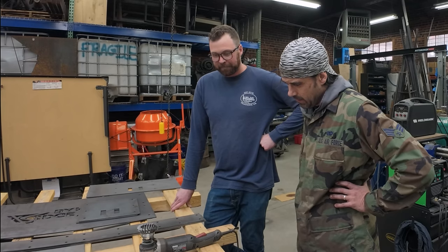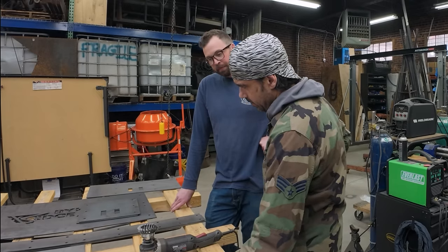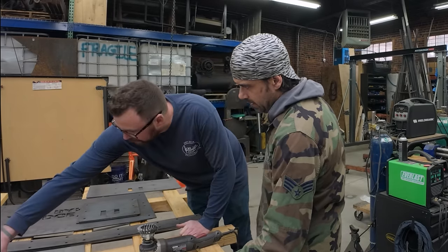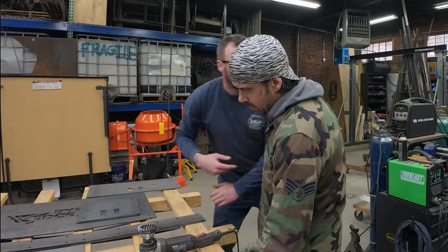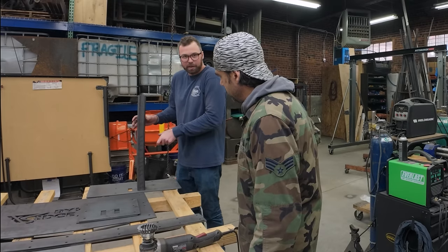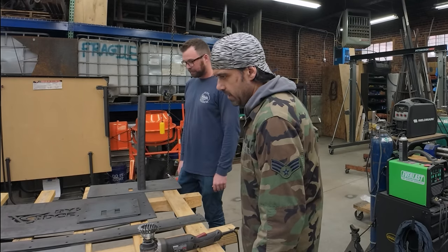Especially with our feet, we have room. What I was trying to visualize is what that's going to do. I know we did off the top and bottom on the material removal. But if we're shorter there, which we are, we can just compensate by moving that up. I think where these weld to here, we could move that a little bit. Because this hole is not the same. How much? You got a lot. We've got easily 3/4 of an inch of bias before the hole even goes off, and even more if we account for the thickness of the tube. Right. Just need to make a match.